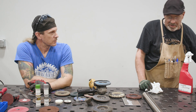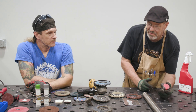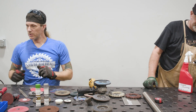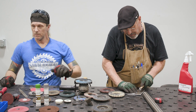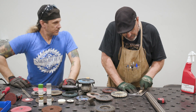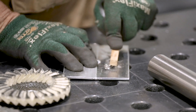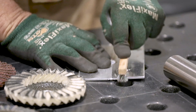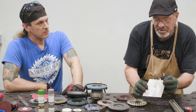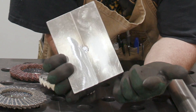What do we do with aluminum? Well, we can clean it — clean the oxide layer off, polish it. That's just cleaning the oxide layer. Give it a little toothbrush-brush look. We knocked that oxide layer off. A lot of people haven't seen this — they think it's clean, but it isn't. And you want to brush in one direction if at all possible. It doesn't feel like this brush is cutting into it, but it's going to start to. Being patient, you can start getting into this surface. You want to brush it in one direction, but that's your oxide layer right there — you're looking at it on my finger.